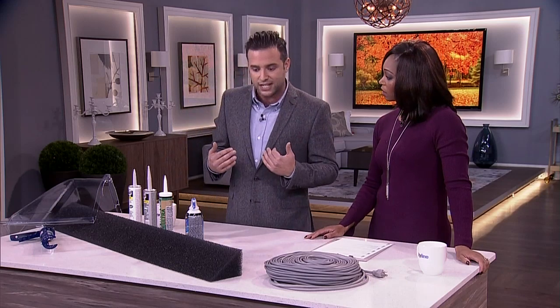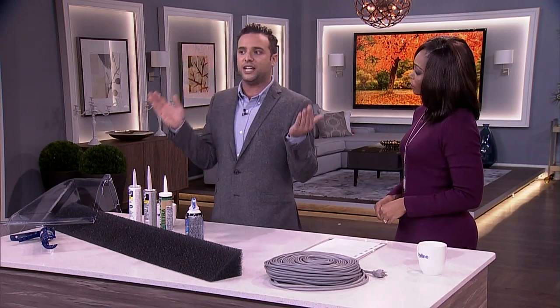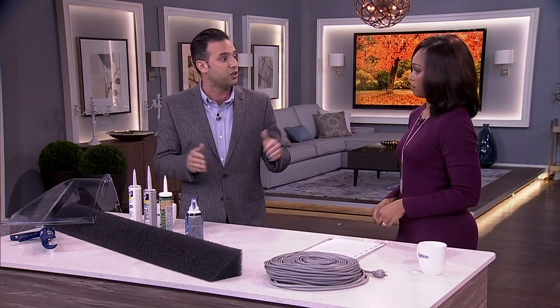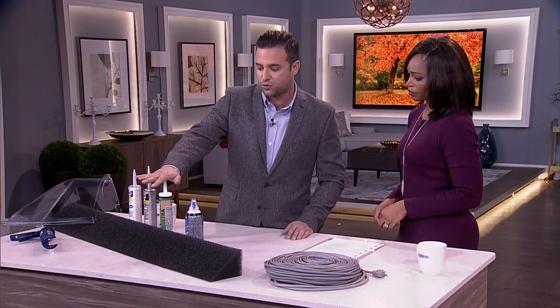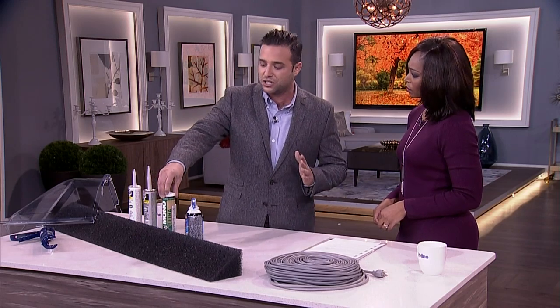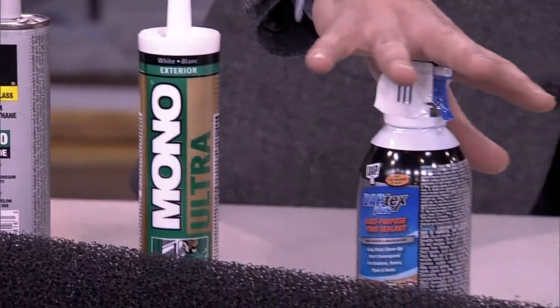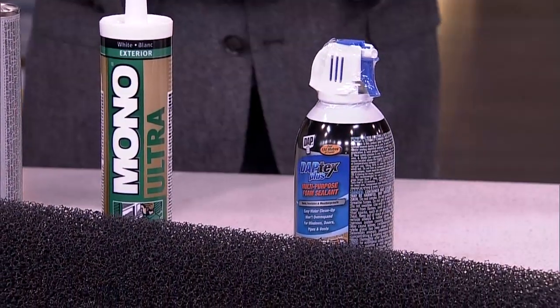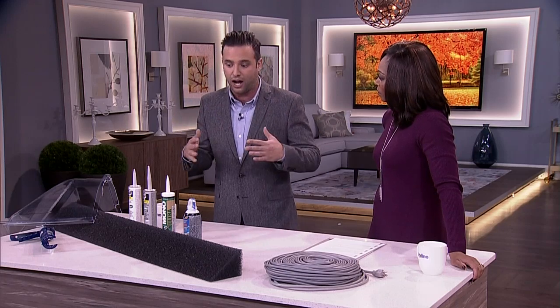So working our way down from the roof and the eaves troughs, we're going to want to pay attention around the windows, because water can get around the windows, causing leaks and drafts. A good example is just regular exterior silicone. It has to be the right temperature, and this is an excellent week to do this. This is a foam filler for any gaps or cracks where pests, water and moisture can get in. The key is to keep water and moisture out of your house.